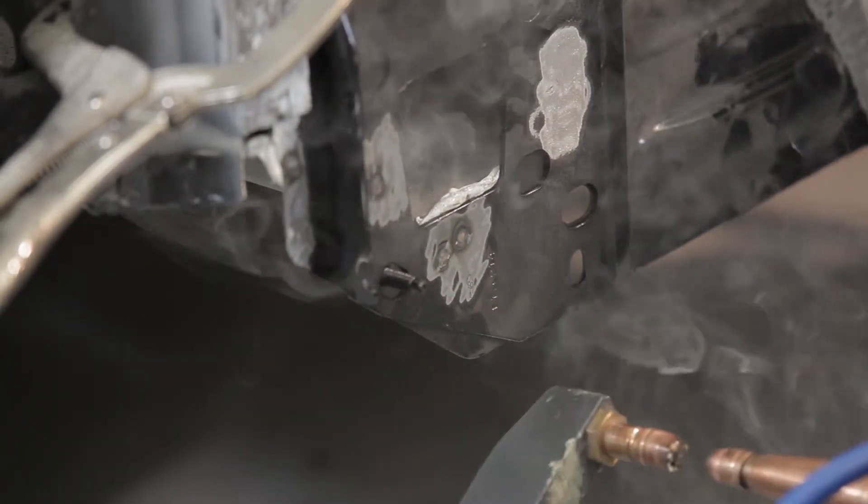What are you most familiar with — automatic or manual spot welders? Semi-automatic, mostly. The automatics are fairly new over the last three or four years. Before that, most were semi-automatic, where you would select the type of metal — whether it was galvanized, high strength, or ultra-high strength steel, or weld bonding — and then set the thickness. With newer units today, they will do thicker pieces and stacks. The earlier ones didn't have the amperage to do the thicker stacks, but the new ones do.